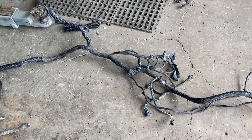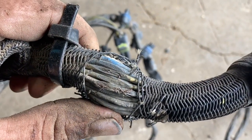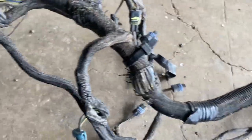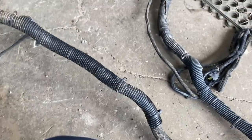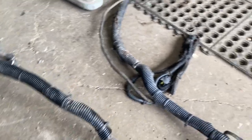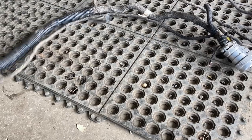As you can see here, this is one spot where it's rubbed through — there's about three wires there that have rubbed through. There's also just a couple of other spots where there's a bit of chafing. We've had a couple of issues and ended up cutting and running new wires to bypass sections of it. This one here is for the linkage — we had to cut that and run a new wire because we just weren't getting the base voltage to that sensor on the linkage.